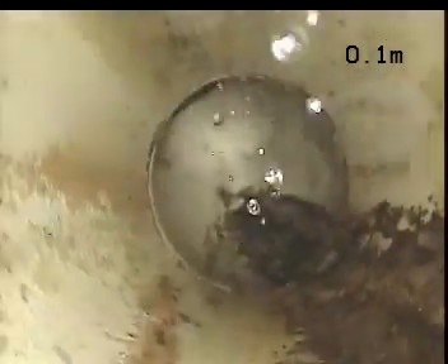I've just removed the toilet pan and performed a jet rod on the main toilet. I'm just working my way down the riser now from the pan connection. The riser appears okay, working through. Now to the horizontal section of drain.